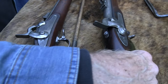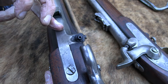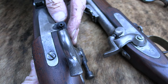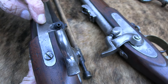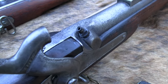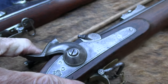Moving back to the lock, you see a little difference. One reason the Springfield lock is the way it is — because of the Maynard priming system on the 1855 model, the nipple is offset out here; it needed to be for that priming system. They kept that when they went to the 1861 model, took the Maynard system off, but kept the nipple out here. So the fire has to come down the nipple and then make a 90-degree turn into the chamber, which works most of the time but is asking a little more of it. You've got a little clean-out screw there. Notice on the Enfield — they never had that Maynard priming system — the fire goes more directly into the bolster right into the chamber. That's a better deal.